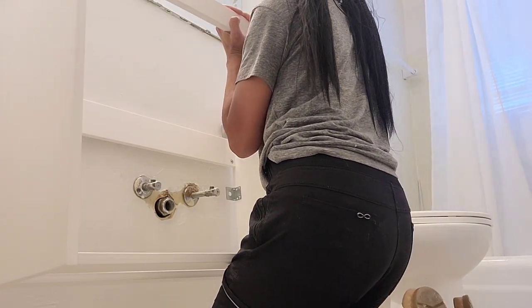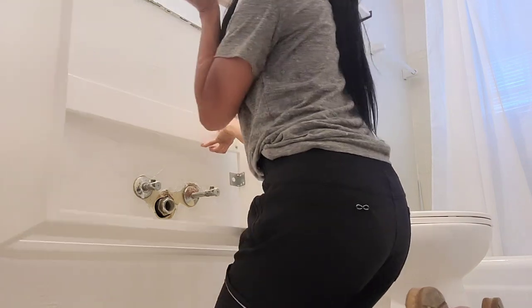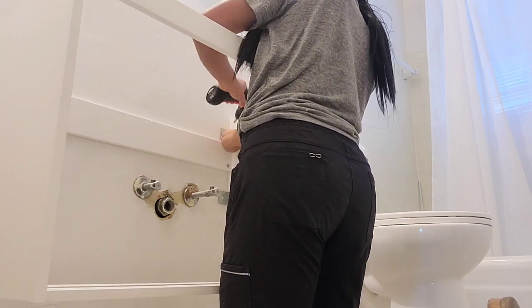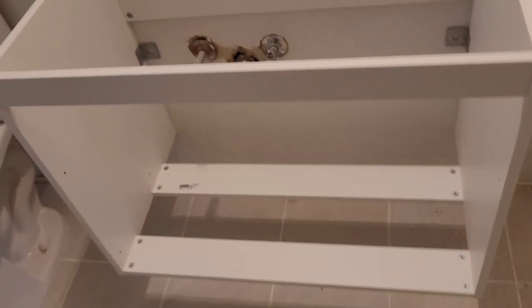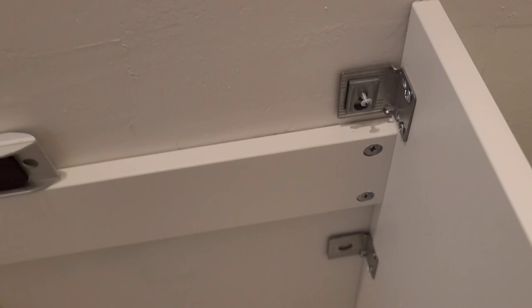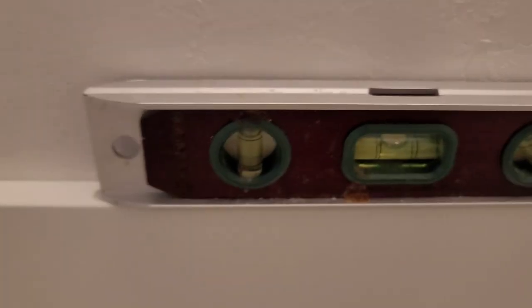Like all these steps, I'm doing it the hard way — you really just have to put the nails in first and then place the vanity on. I literally carried the whole thing by hand and realized looking back at the instructions I could have just put the nails in and then put these over them. Also keep in mind how far away you want it to be from your toilet to the wall — just keep in mind you want good spacing. These hooks right here will go over the screw once you put the mount on, and that keeps it locked in place after you screw it. So it's actually hung onto the wall now — I'm not carrying it. I'm using my level and it's close enough.